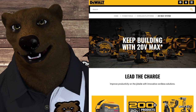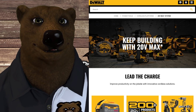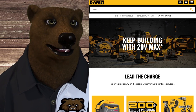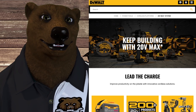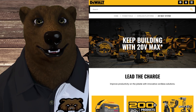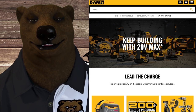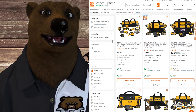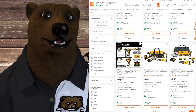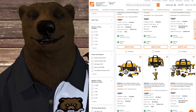The heart of the system is going to be your 20 Volt Max. Remember, there's an asterisk behind 'Max' — that's a marketing term. It's really 18 volts. When you see Milwaukee, Makita, and Ridgid saying 18 volt, and DeWalt saying 20 Volt Max, there's no difference — it's the difference between peak voltage and nominal voltage. In fact, the marketing term is illegal in many countries; all of Europe considers it false advertising. These are lithium-ion — the core units you see at Home Depot, everything from drill drivers to impacts to recips to grinders.